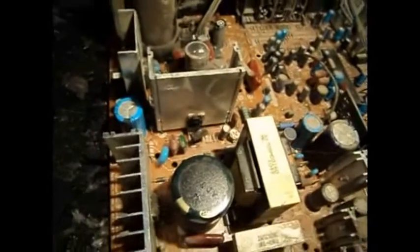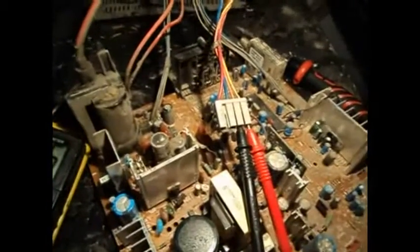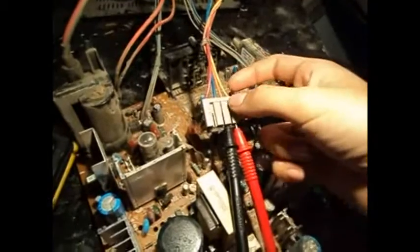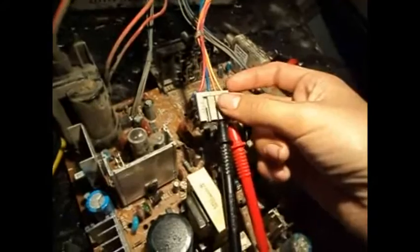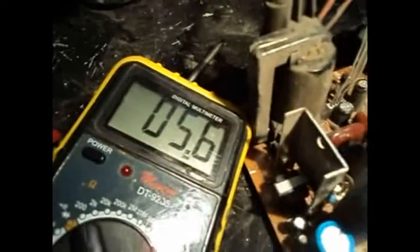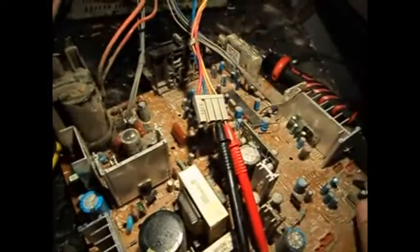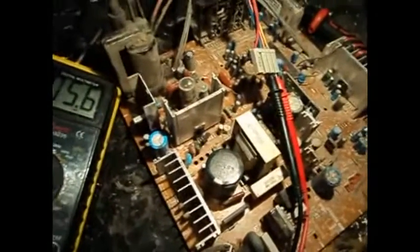I'm going to try and see if I can prevent the new one from blowing up when I put it in. I'm checking out the yoke — I believe this is the vertical. Usually the horizontal is about 3 ohms and the vertical is 10 ohms, or it might be the other way around. But one of these seems a little bit too low — it's measuring about 5.5 ohms. This one measures 3 ohms, which is normal. So I'm wondering if this has a short somewhere. I did notice a lot of this glue stuff flaking off and it looks cracked, so I wonder if maybe that yoke is bad, because that is a pretty catastrophic failure.